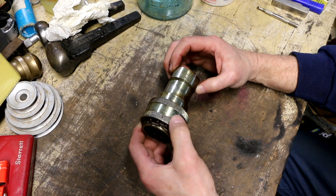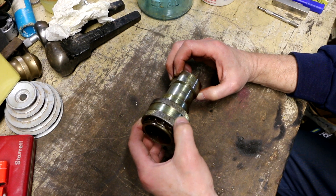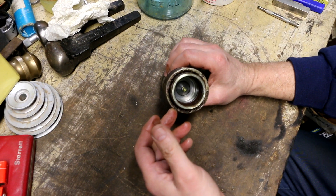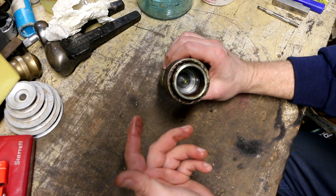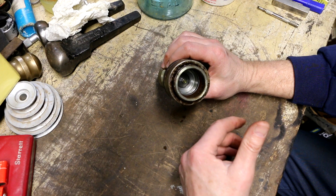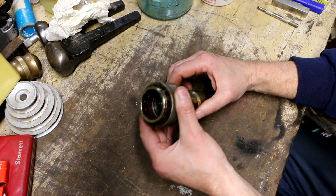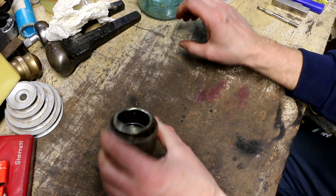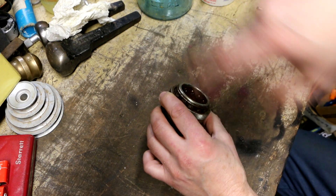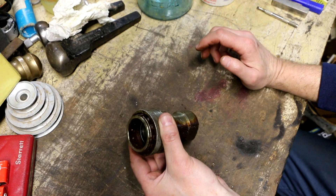It has a wheel loader and backhoe assembly on it. The backhoe is detachable, and there are two large hydraulic lines that are supply and return from the tractor's hydraulic pump. They go to the backhoe attachment. The idea is that you can disconnect the backhoe and disconnect these lines, then hook the two lines together so you don't have a deadhead — you're not dead-heading the pressure of the pump — and you can drive the tractor around and just use it as a loader.